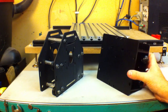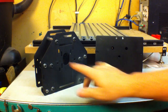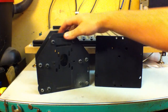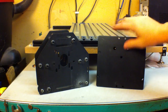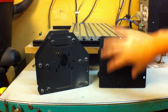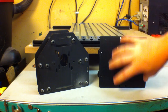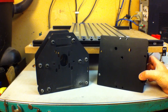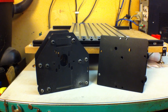Another really cool thing I noticed is where the bolts make up the support that holds these two plates together — this one doesn't have any of that. That means you could put an 80-millimeter extrusion on here with open rail on it and make a much bigger, beefier Z-axis. So that might actually be one of the things that makes this really, really cool.